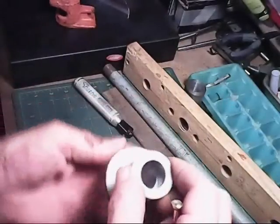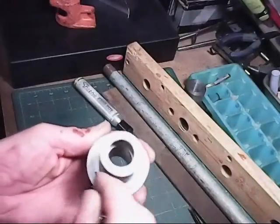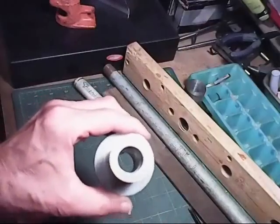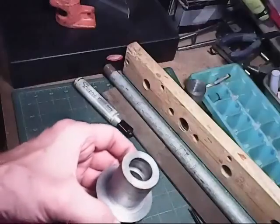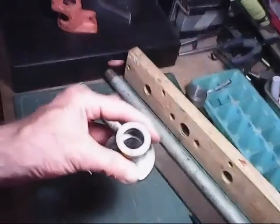The reason why I had to take so much off the diameter here is because I need some room here on the flange to be able to put screws in through to fasten that to the board. But that worked good for getting a nice shoulder in there. It worked real nice for that. Getting an internal groove like that. Okay, let's do the next one.